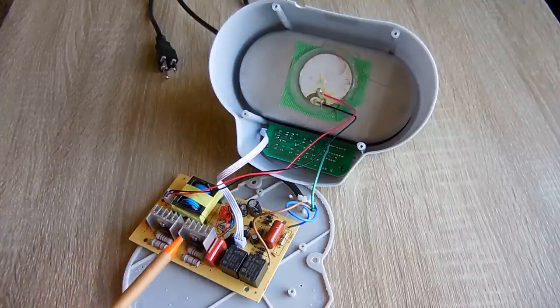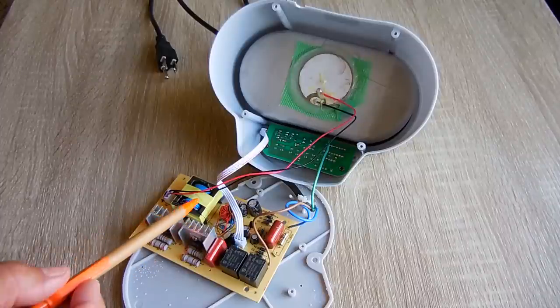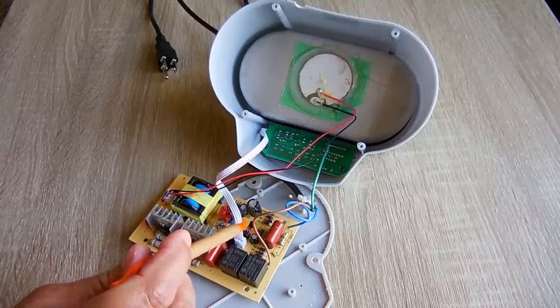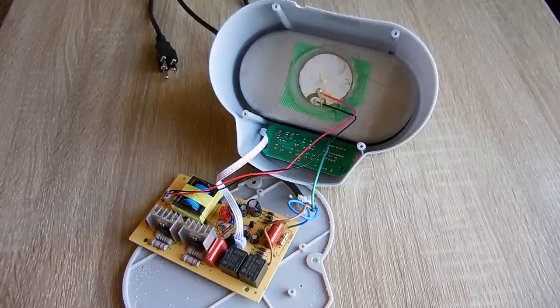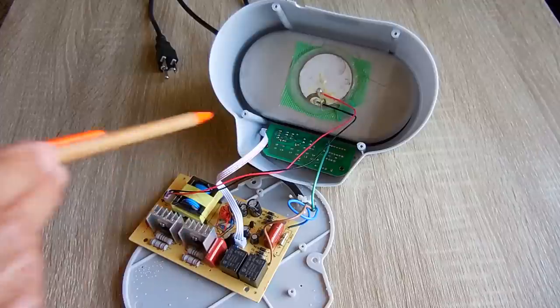These two transistors here are D13005 NPN transistors, high voltage, and they're used to create pulses inside this transformer. Over here, hopefully you can see it down low, that's a 78L05, that's a 5 volt regulator, 100 milliamp output, and that output is being sent to this board.